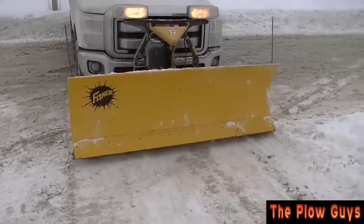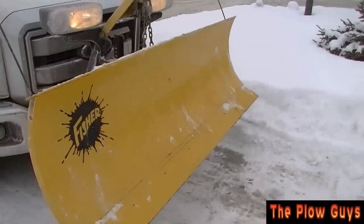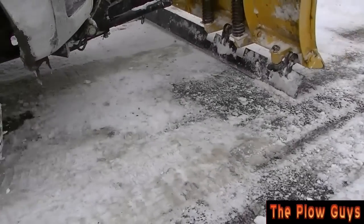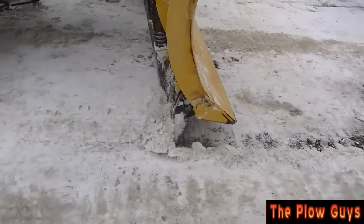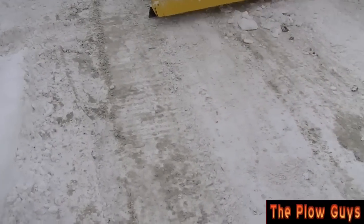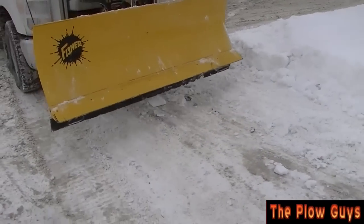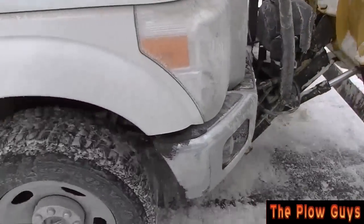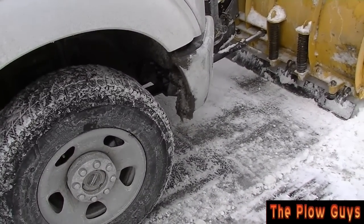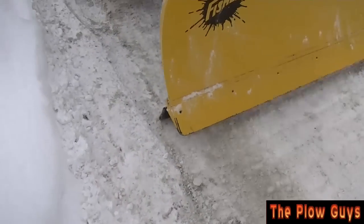So what I'm thinking of doing — while I'm working around here in the snow I'll explain — is getting some steel tubing, putting it in place of the shoes, and making the tubing into an inverted T. The top of the T will actually be underneath between the back plate and the plow, and I'll use that as a stop gap for the back plate to rest against. I'll make a couple holes in it so I can adjust how far down it goes, but I don't want it to go right down to the ground — I want it to stay up. I think that would fix the problem.